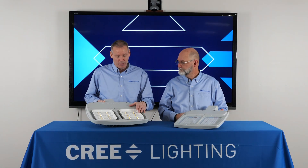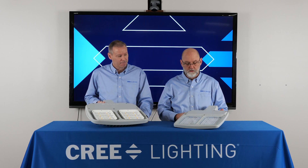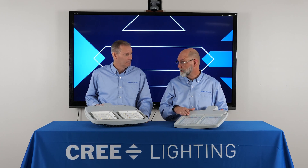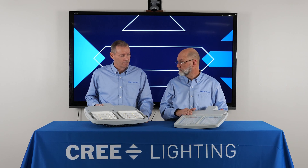Sean, the OSQB uses a high-powered LED. The C version is mid-power. How did the team decide on that? One of the advantages of going to a mid-power LED versus a high-powered LED is all about thermal management. With this platform, we don't have to drive the LEDs as hard, so our drivers are not creating as much heat. And as a result, we're able to take a considerable amount of weight out of the housing because we're not having to use as many cooling fins.